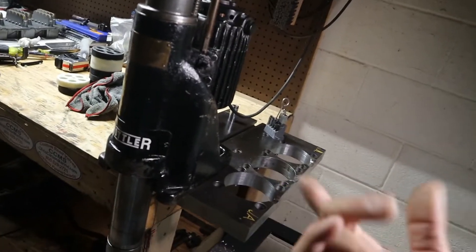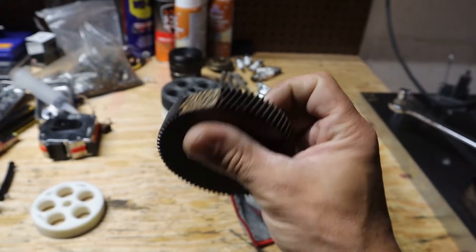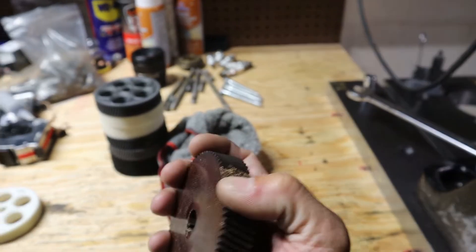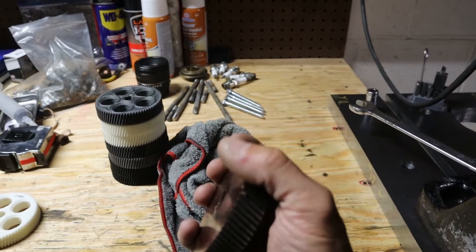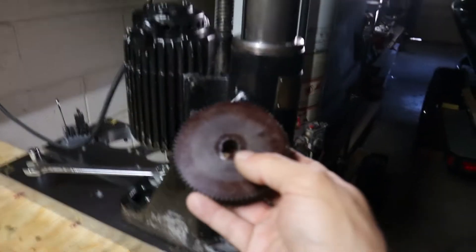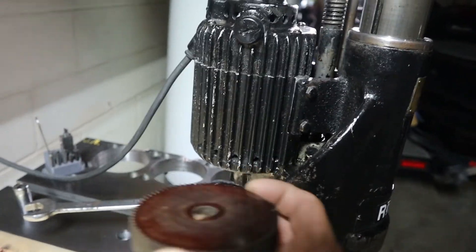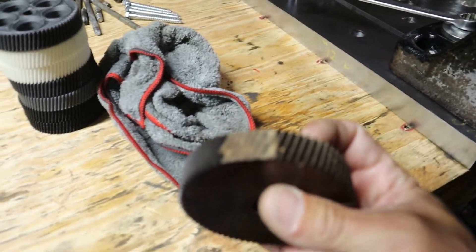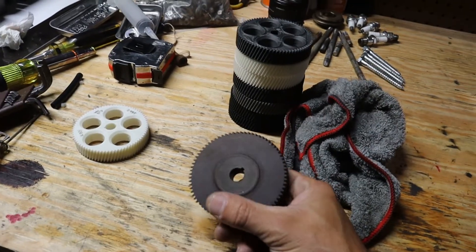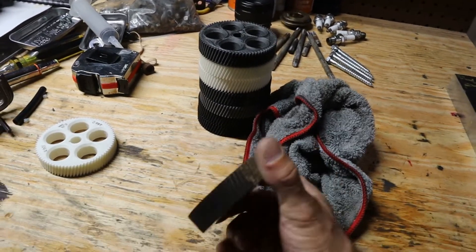Pros and cons: the number one con — when I got it, on the second hole I cut, the original micarta gear bit the dust. I mistakenly let the bar go just a bit too far and scraped the bottom of the cylinder, the aluminum casting where the rod slot is, so it dug a little too deep. This gear is sacrificial — every other part of this machine is made of steel. This is the only composite part on the whole machine: a silent reduction gear located inside the gearbox. Rottler has no intention of providing me with one because it's a 100-year-old design — they're not interested in retooling their production line to make an obsolete gear.